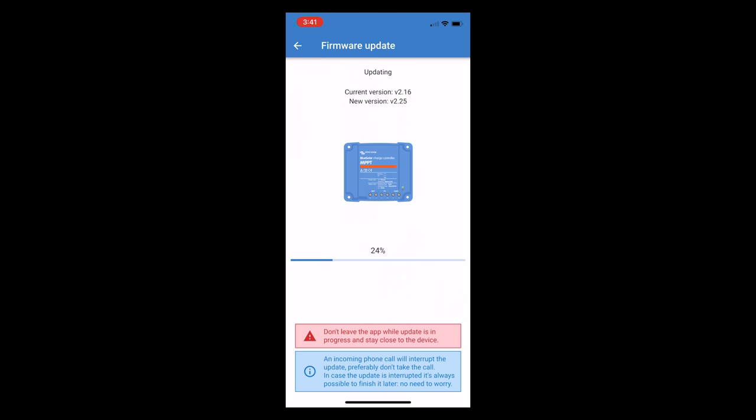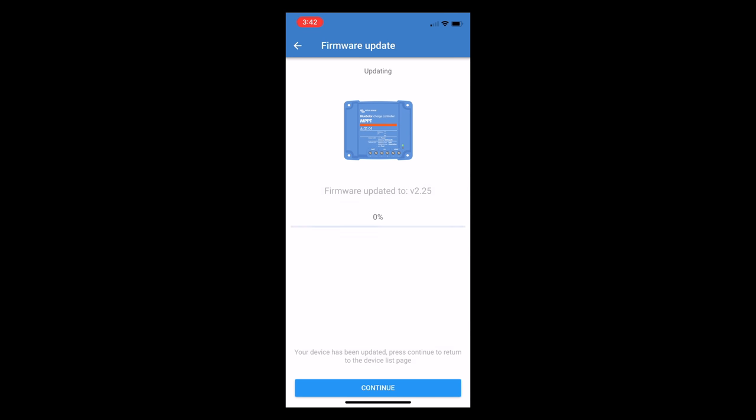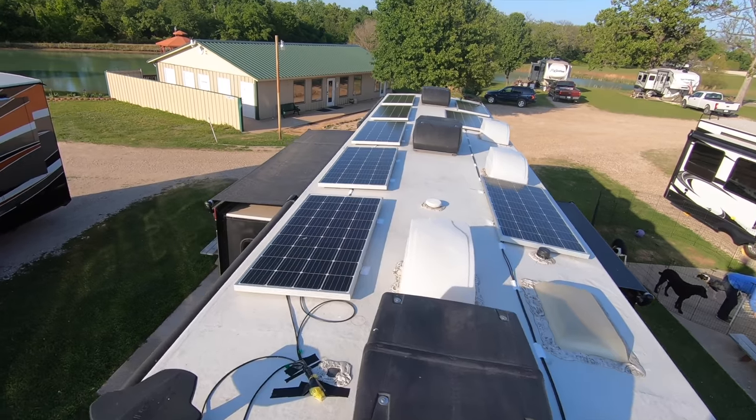So let's chat about the Victron and why I got it to fix some of these issues. Number one: firmware updates over the air. You just click download, install, and it's done. This is all done through the Victron Connect app, which is another benefit. The Victron Connect app can see the MultiPlus, the solar charge controllers, and the shunt. And when we get to the Cerbo GX, it's going to bring all that together in a really cool interface where I can see everything at once. It also interacts with the other Victron components — the solar controllers and the Smart Shunt. All the Victron components can work together in what's called a VE Smart Network so that the inverter can know about the battery levels through the shunt, and they can all work together.